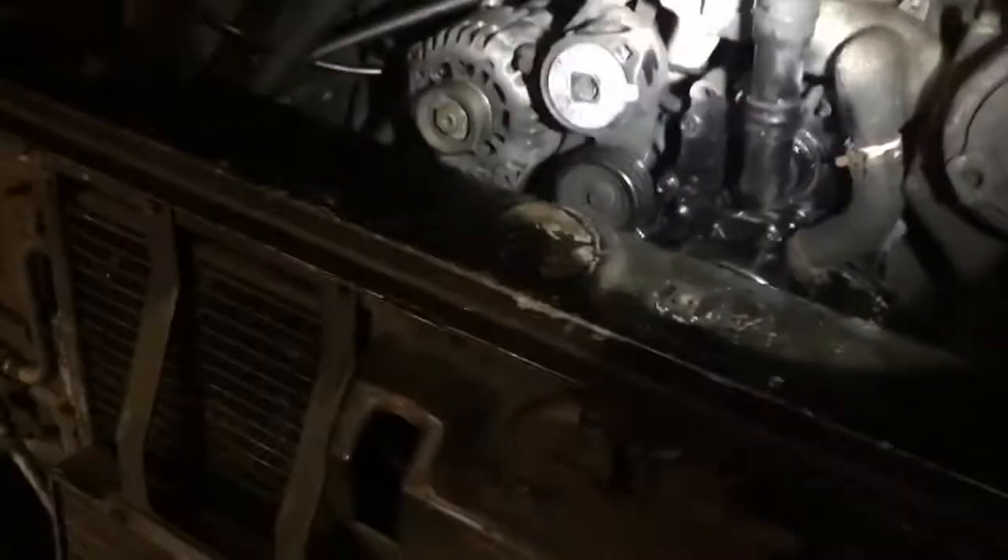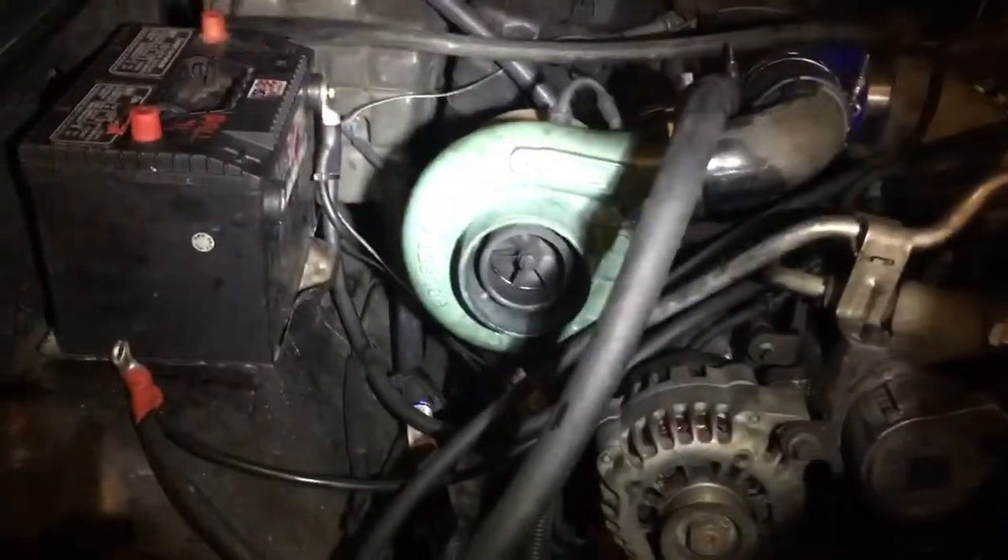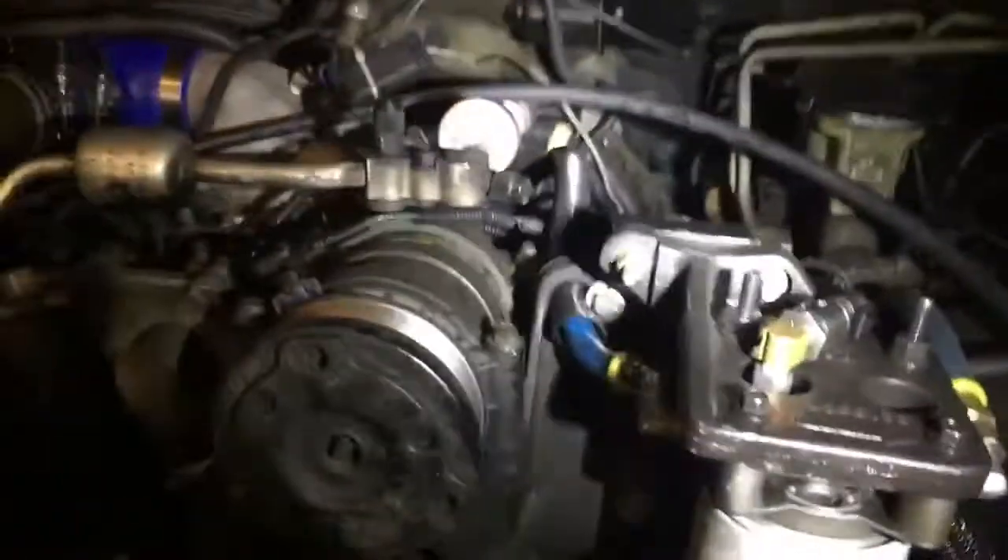I also tightened up a couple of fittings. You can see the turbo is going to need work — the turbo wheel has got a couple nicks in it and some oil starting to seep in, so we're probably going to rebuild it. But that'll probably be after plow day.